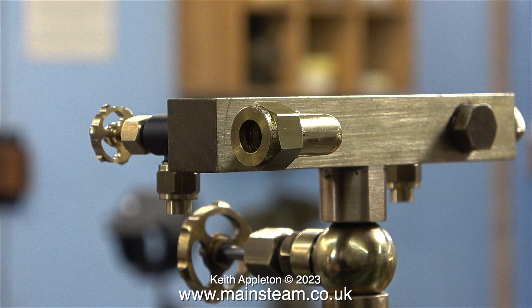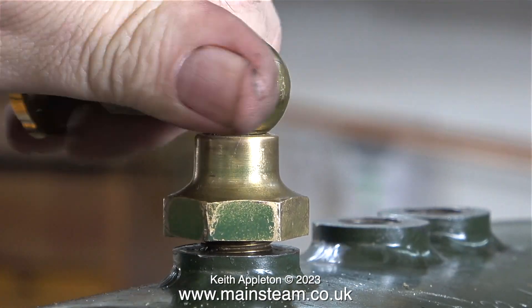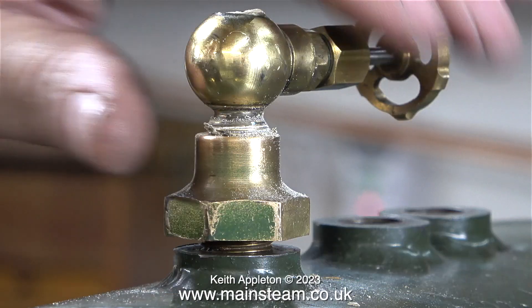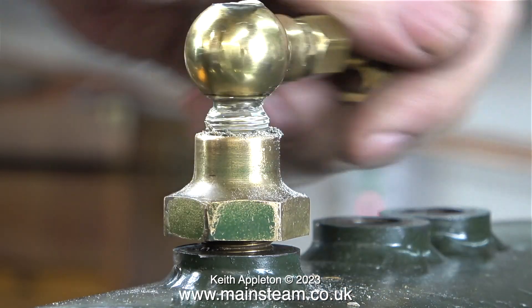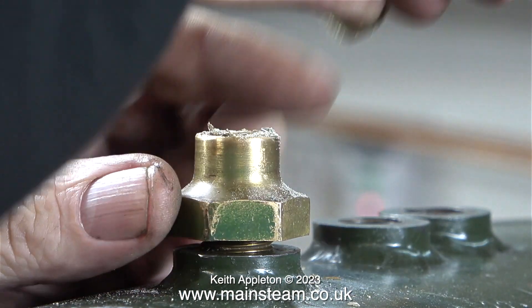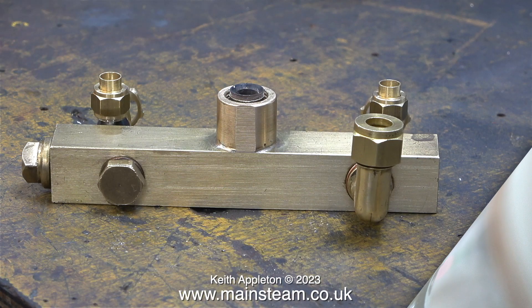After this I removed the elbow, put some shim washers in place, then re-tightened it so it pointed downwards — I didn't video this part. Unfortunately the top thread of the isolation valve broke off, and I didn't video that part either. Here's the broken globe valve: the screw threads are silver soldered into the main body and the joint wasn't strong enough — it failed. All is not lost though; I'm actually quite pleased this happened in the workshop rather than in service. And honestly, I didn't like the look of it anyway.